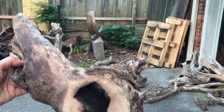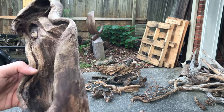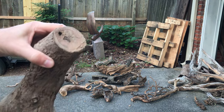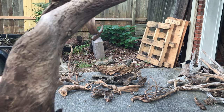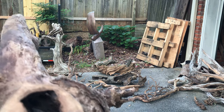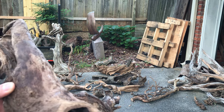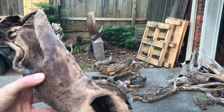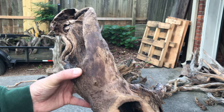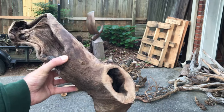I'll sand this up and see how good the wood is. I always try to make sure it's not rotten and not infested by insects and bugs. If there's some ants in it, it's okay — ants will eat out the soft parts. But if it's spalted, that can be good. Spalted wood is decay, and it can be fungus, and it could be just too soft and damp. So I try to get the wood that's hard. That's my first tip.